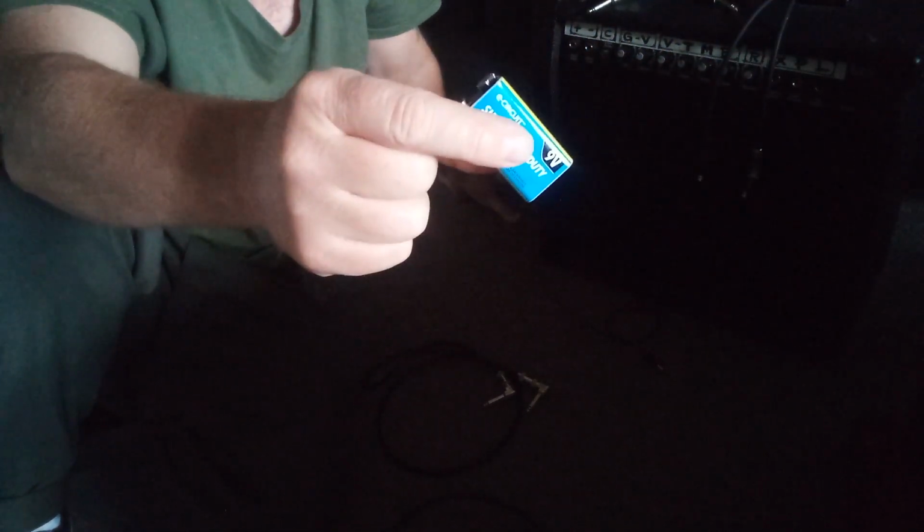So I had old effects. I had an AD999 delay. I had other delays as well. So I know that delay sounds severely good. And with electrical power, they all stand right up on end. So they sound different with electrical power than with a battery, which is notable, which is cool. You know, some people like that battery sound, sometimes. And if you have that sag feature, turning down the voltage is not sag. A big part of the sag is that the milliamps are extremely low in a battery. And when the voltage grabs it, it sags because it's only so many milliamps.